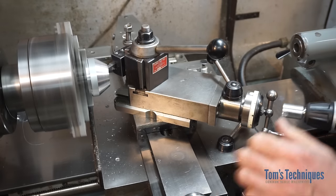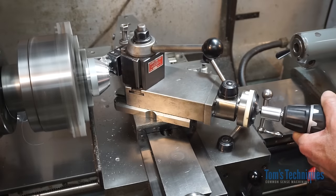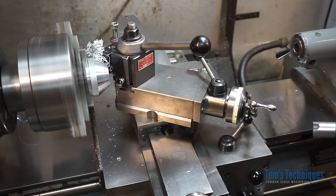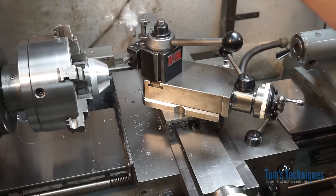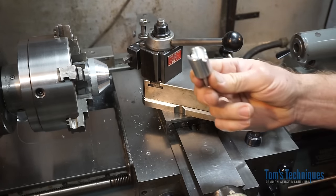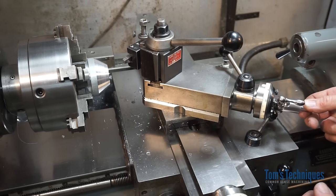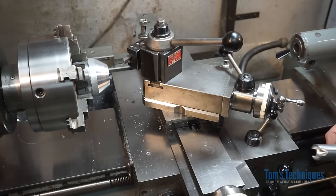Let's take a little deeper cut than that. It gives you a nice even feed rate. There are no marks from stopping the tool on the work or from varying the speed — it gives you a really nice surface finish. Pretty simple to make; just a piece of aluminum. You'll have to adjust yours to suit whatever crank you have on your lathe. I made this with the hole about a sixteenth oversize and the slot about an eighth inch oversize — gives it plenty of freedom so you don't have to stay perfectly lined up on the crank.